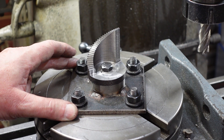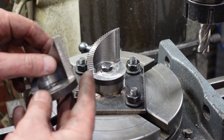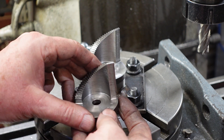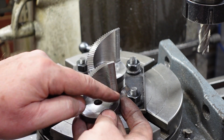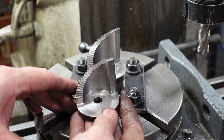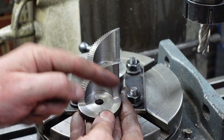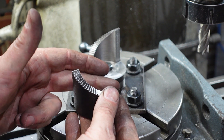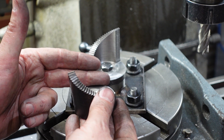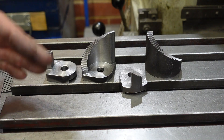I've put the fixture up on the rotary table to do the cleaning up. The reason for the rotary table is that these lines here are radial — rather than trying to line things up on the table and then turning a little bit for each one, I've opted for the rotary table. As I mentioned earlier about offset cutters: if I want a nice radial line, the cutter has to be on this side of the line, and when that turns around to get that radial line again, the cutter has to be offset in the opposite direction. It's something to remember when doing this sort of thing.